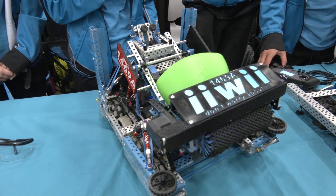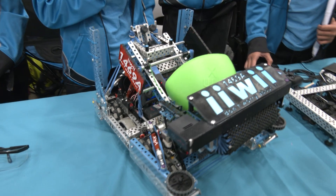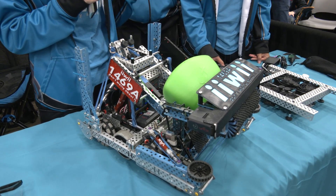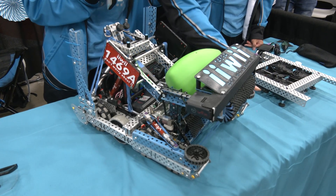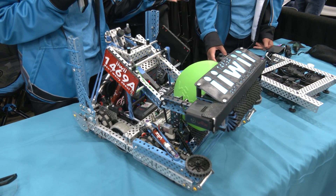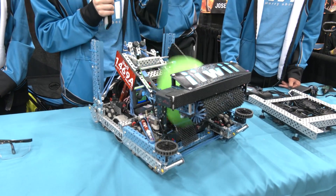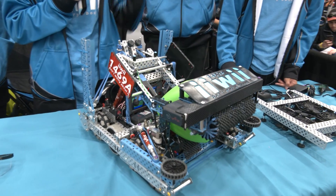Something I want to ask is I love having the tri-ball up this far, but as you mentioned you're not really able to have a full trap door. Is there any concern that if you get hit too hard in the front the tri-ball might pop out? There is a little bit of chance of that happening — sometimes if we have a bunch of balls in front, there is a possibility of it popping up. Overall though, because our kicker is up here and it's paired with our hang, the moment the tri-ball goes up it just slides back down. And this is another feature — we can actually match load from up here and it just slides down.